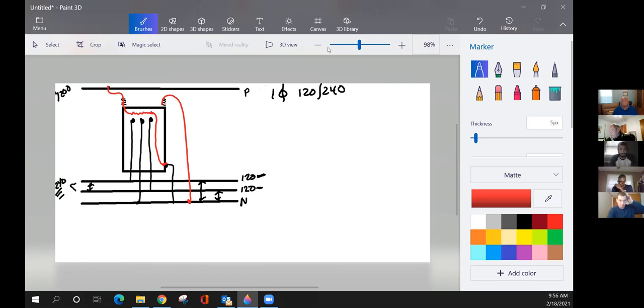And all transformers as well, regardless of whether it goes back out of the second bushing on the top or it's connecting to the tank, all transformers have tank grounds on them. That tank's always grounded. I have seen certain situations where, like Professor Shoemaker said, I've had to go behind contractors where they hooked up transformers wrong, and the tank would have primary voltage on it, and it'd be smoking on the pole. It'd get so hot on that pole connected to the wood, it would just have it smoking. So those ground connections are very important when you're hooking up primary to a transformer.